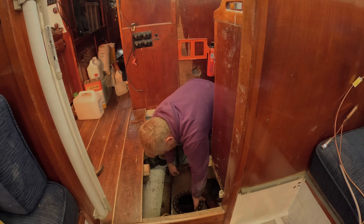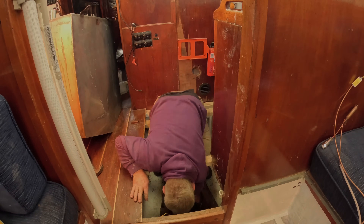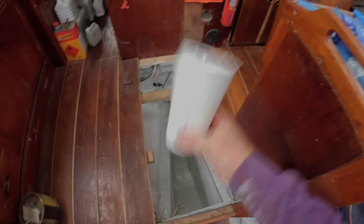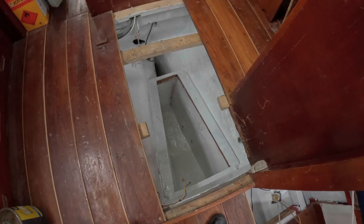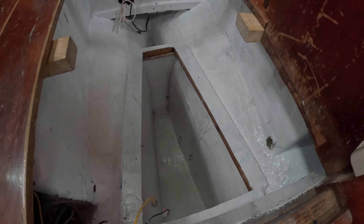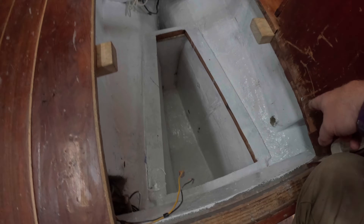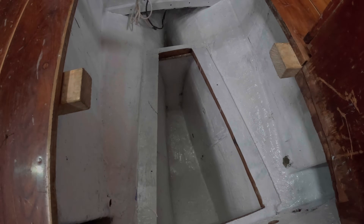The paint pot fell in there upside down — that's fine. What used to be a big fuel tank — now I didn't need to paint that because it's going to have the stainless steel tank in it, but I thought do as much prep as I can. It's got that big mahogany frame all bonded in, and I've filled in around the edge with thickened epoxy so that any water running down the sides will run down the channel into the bilge and be picked up by the bilge pump. The tank will sit in here and I'll put a lid over the whole thing.